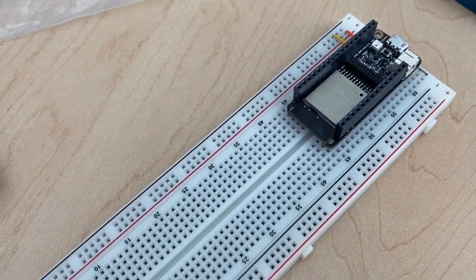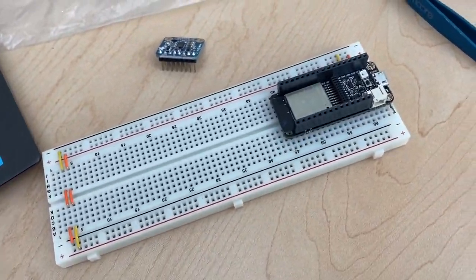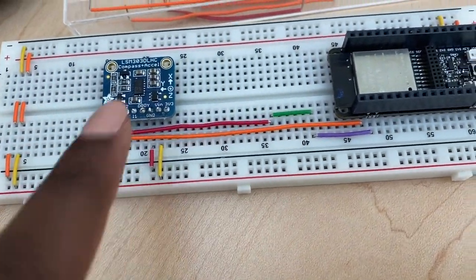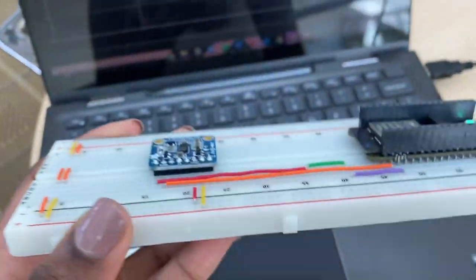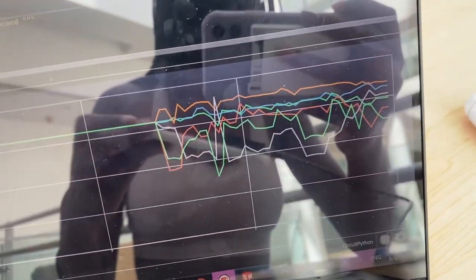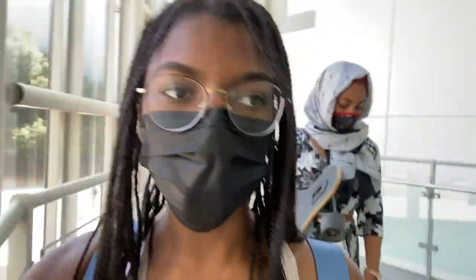We split into groups and I'm in charge of setting up the accelerometer, which will go inside our device and let us know if the bike has been moved. I set up the circuit — plugged in, with two power pins and an I2C connection to get data from the accelerometer to the board. I can tell it's hooked up properly because as I move it around, different data shows up on the graph. For testing purposes, since I couldn't hook up the actual alarm, I made the light turn red while it's accelerating.